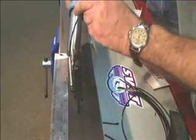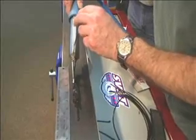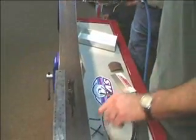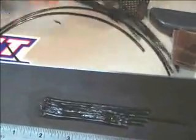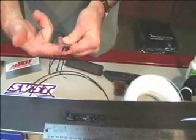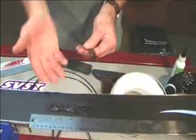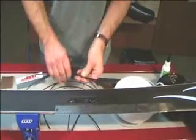Now when you're cutting that off, Ed, you're lifting the tip of the welding unit up and pinching it off? Is that correct? We're rolling it over on the soft weld material and pinching it off. What we're looking for is to stack the welds side by side. The weld is actually melting the bottom of the rod, which is in the base itself, and the top is staying solid. Won't allow any air bubbles to come up.